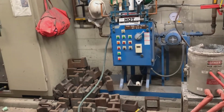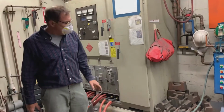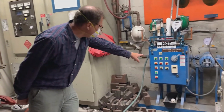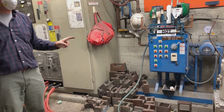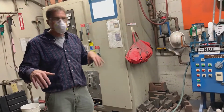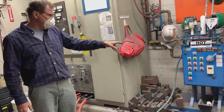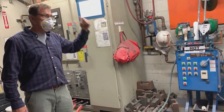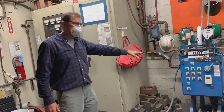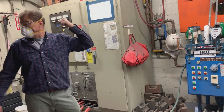Okay. So, as you're doing stuff in the lab and you're melting, every once in a while you should look over at that thing, and if it's ever over 80 degrees, come get me right away. I think 82 is okay. The fan comes on, it goes back down to 80. The deal is that one day we did some electrical work, and they forgot to hook up the fans. It looked like it was working over here, the pump was going, but the fans weren't hooked up. So we're running that furnace.